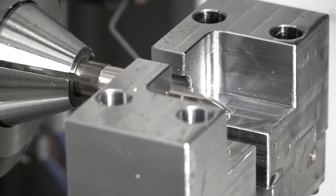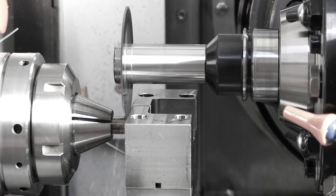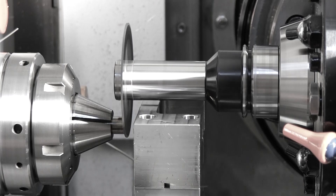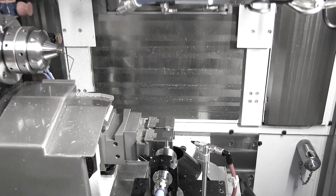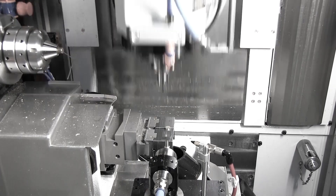Also, the back working vice comes over, you grab the part, and then you actually mill it off before you take it away. Normally you'd see a spindle with a sub-turret come in and you part it off, but here you can actually mill it off and then stick it right in the parts catcher.